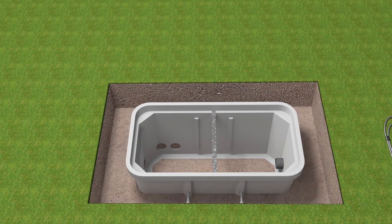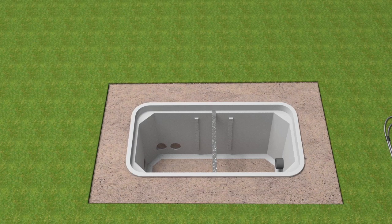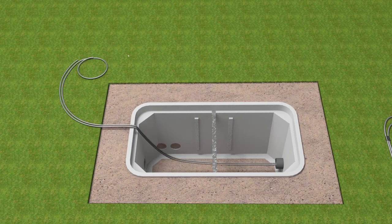Backfill with stone aggregate around the mounting sleeve. Pull feeder and distribution cables out of the hole and coil them on the ground.